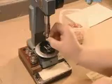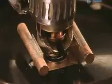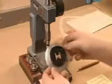A chemical cleaner is sprayed into the pivot cavity — it has to be spotless because any dirt would impede its function. A small jewel post containing a tiny sapphire is also cleaned. Then the jewel post is fixed in the dial. The post will support the dial while allowing the pivot needle to move easily as it's pulled by magnetic forces.